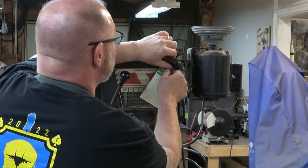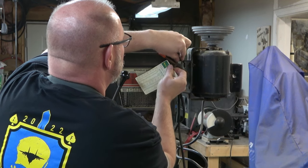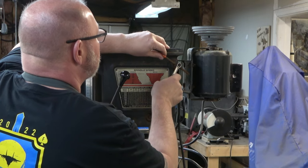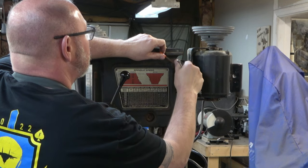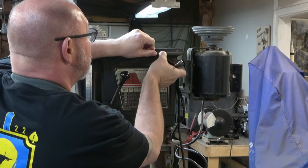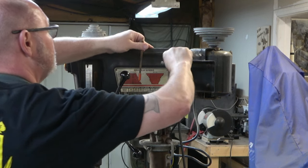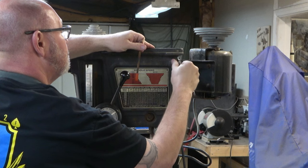Next, we're going to go ahead and remove that drill bit reference card that's hanging on there — that the previous owner had. Next, we'll remove the adjustment assembly. You've got this screw on the end and then the adjustment rod, and then you've got the adjustment mount, which is that center part that I'm screwing out of the head now. And you notice how the motor swung out of the way — it's hinged on the other side.